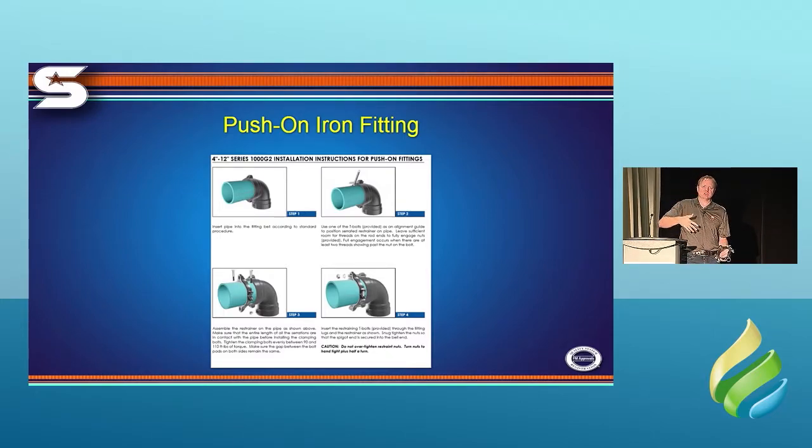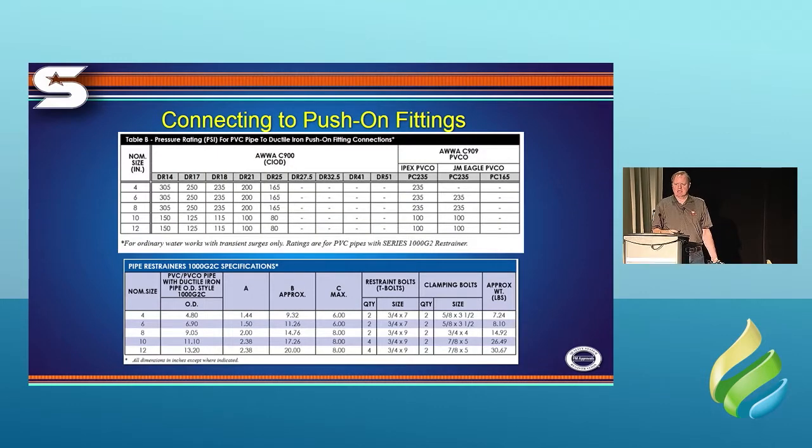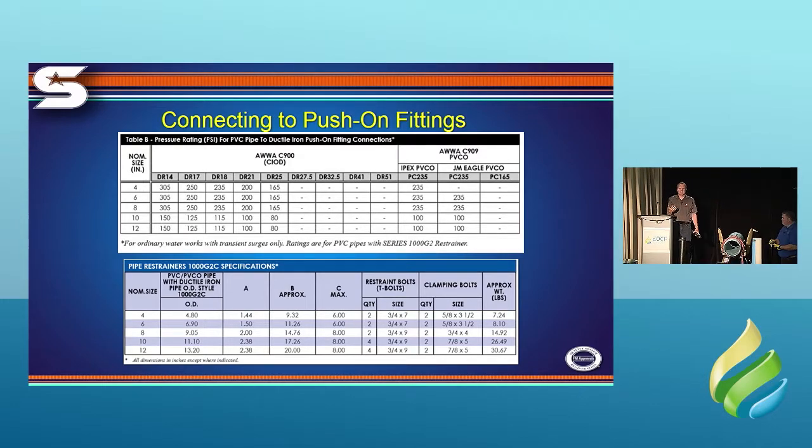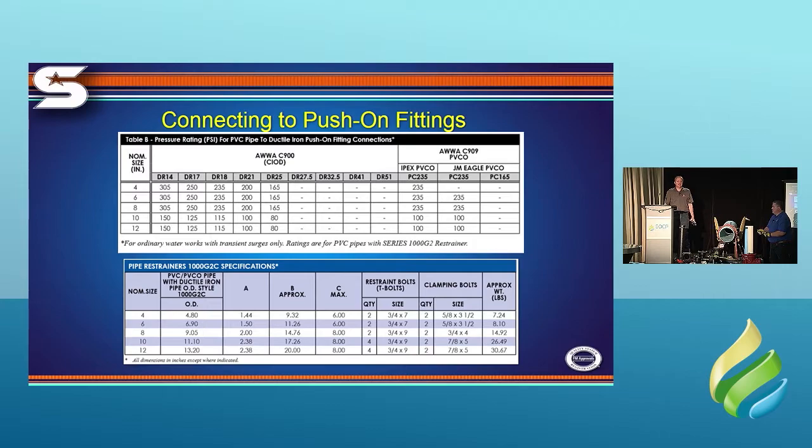And that's us, that's every manufacturer. It depends on whose literature you're reading, how it's written. How we write ours is we reduce it right in our literature. It says for 10 and 12, if you're at a 200 PSI pipe, you're now derated on your plastic pipe to 100 PSI on 10 and 12.